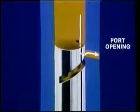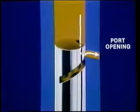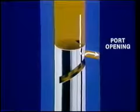When the control edge of the plunger helix uncovers the port, pressure falls to supply pressure, shown in orange, and that stops delivery of fuel. For smaller plungers, a single helix does the job. But for larger plungers, a double helix with 2 ports handles a greater quantity of fuel.